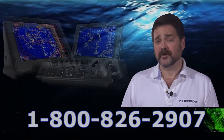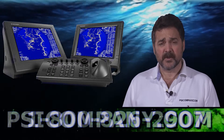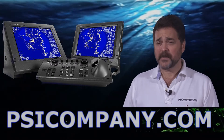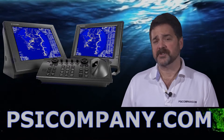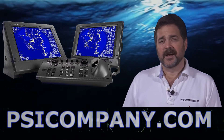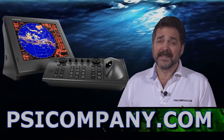This is an S-band style color LCD radar. Now the term S-band may throw you a little bit because most radars are X-band, but S-band is basically a little bit lower frequency radar and has some different propagational characteristics. Commonly you'll hear people say that S-band is for the birds, but we say it's for the weather — and both are true.